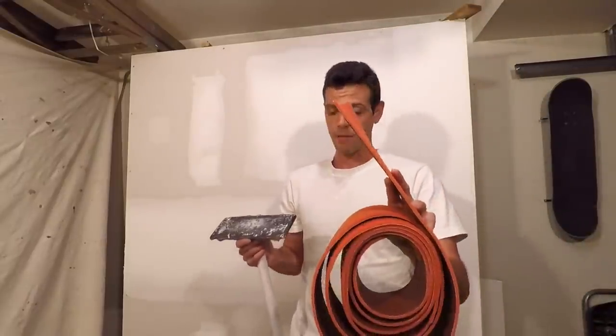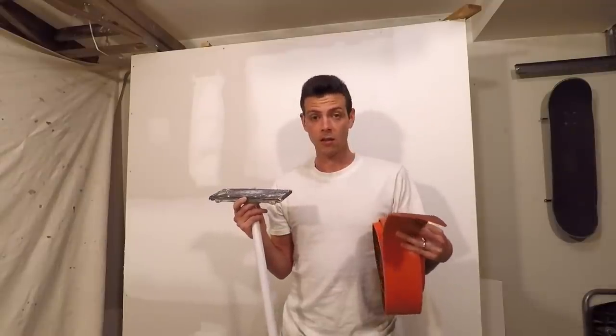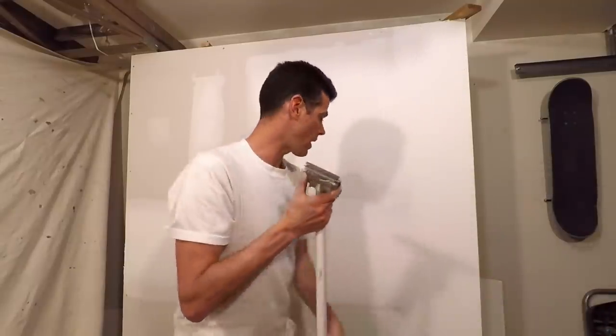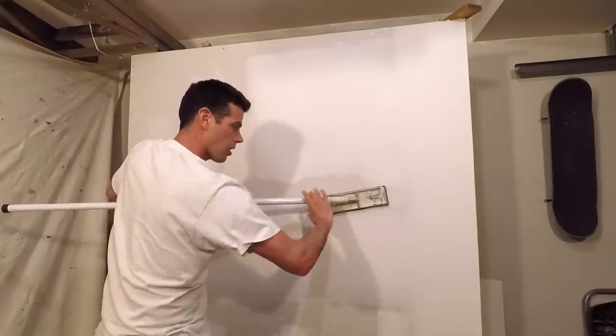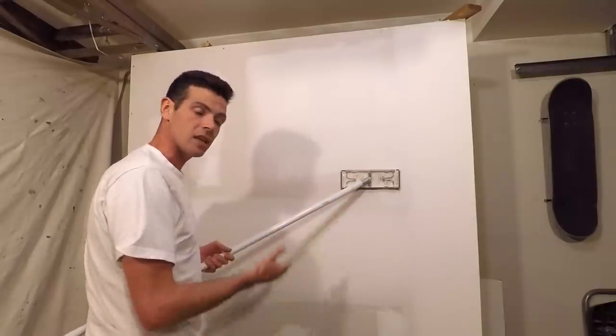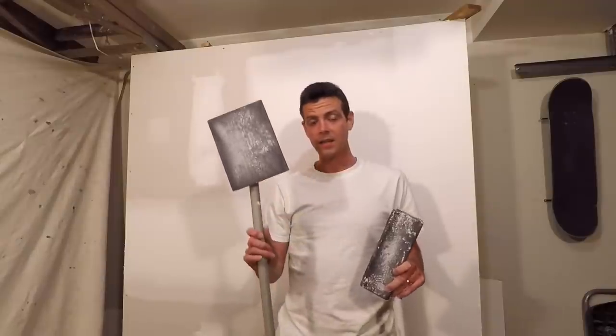For the finished coat, I use foam-backed sandpaper on the Better Than Ever Super Sander. This foam-backed sandpaper is a lot like the Black Widow — as long as you sand properly, it doesn't leave any scratches. Because this is so narrow, when I'm burning down finished edges I can put extra pressure on it and it's more concentrated in one area. So it's just a couple of pushes and it's gone, whereas the other ones don't actually do it properly. Even though this is narrower, it does not take long to cover ground.